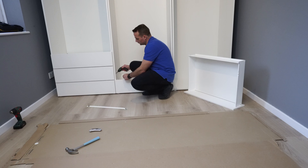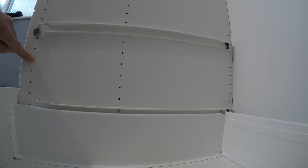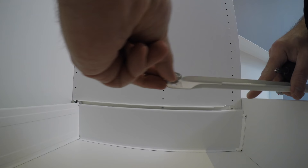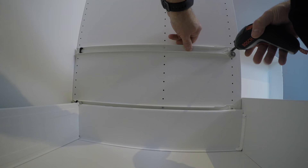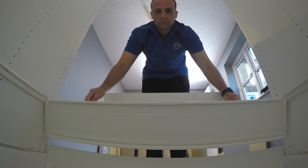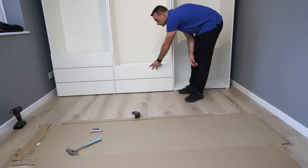The second one is hole 13 — that's for the second drawer. Secure the rail on the side with three screws. Make sure those screws go all the way in, otherwise you may have a problem sliding the drawer in or it'll make a metal-on-metal sound. Secure the screws all the way so the head of the screw lines up nicely in the rail. Just swap them over and it's going to match — over the wheels, lift it slightly up, and slide it down and in.